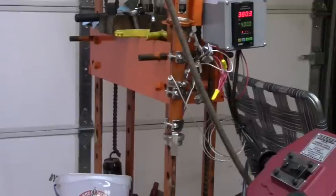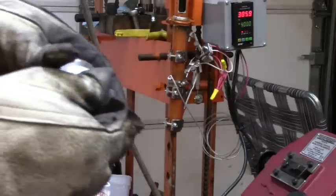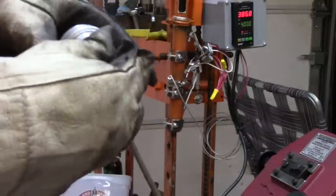All right, this is the second one. I've plunged the piston down in there about 3 times. I didn't put any new plastic in because there's plenty of plastic between the bottom of the piston and the bottom of the injection thing there at the mold. Now there was a little blob hanging out when I screwed it back on, and that little blob may have been soft, it may have been hard, I don't know. So I guess what I'm going to do here is lift the ram up on the thing and unscrew it and see if we got another part. So we're going to get right back in the camera, I hope, and we'll see if we got anything in here.